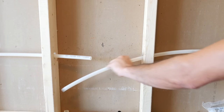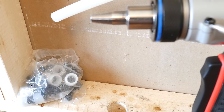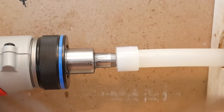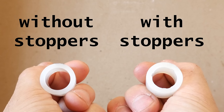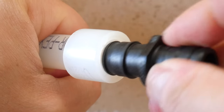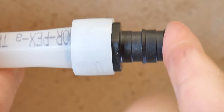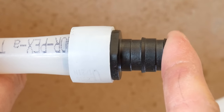Now let's make a few connections together and go through some of the important things to remember when working with Propex. The first thing that needs to be done is to push the ring onto the pipe. Before, Uponor's rings didn't have a stopper and would go beyond the edge of the pipe, so they improved them by making a stopper at the front which ensures proper placement, making them basically dummy proof. As we see here, the fitting won't go in. So the next step is to expand the joint until it reaches the shoulder of the die. Give it a few extra cycles to buy you some time and quickly insert the fitting, ensuring that it reaches the stops. At this point, you want to keep the fitting there for a few seconds to let the pipe shrink itself.